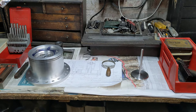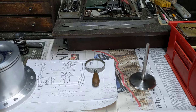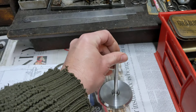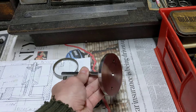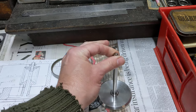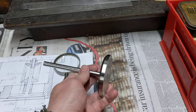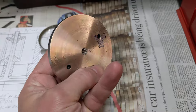Hello and welcome back to the Project Hercules Diaries. It's nice to have a finished part — unfortunately we don't have a finished part, we have an almost finished part. It's been a cracking weekend with our village festival, but we have got the old valve of unknown providence machined down to the right diameter so it fits inside the head, and we've got the right 45-degree chamfer on it. There are two outstanding jobs.